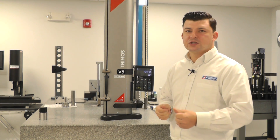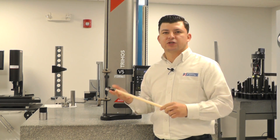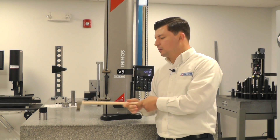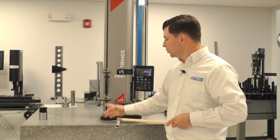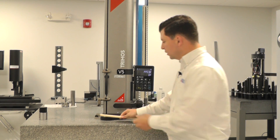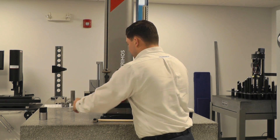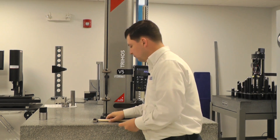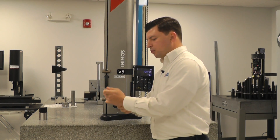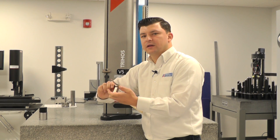Settling in at OK means that our balance is right where we want it to be. Now let's change it and put on our larger extension. We have this 12-inch ceramic extension, which gives us a much greater reach than we were able to capture with our standard probe. So I'll take my probe holder off, release my probe, apply my probe to my extension, and lock it in.